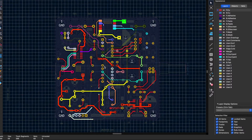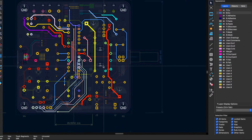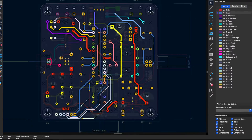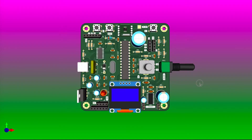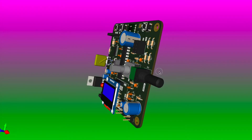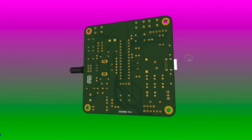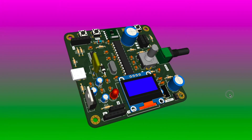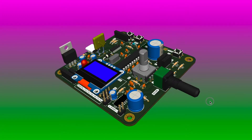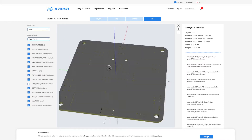Next, turn the schematics into the PCB design. This step took me a lot of time, because I did all the routing by hand. And in some places, I almost did it pixel by pixel. Since I couldn't find a ready-to-use symbol and footprint for the RDA5807M, so I created my own. And it looks not that bad. After all the tuning, I am finally satisfied with the tracing.